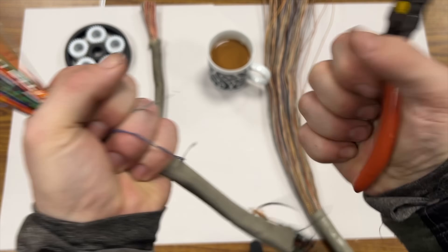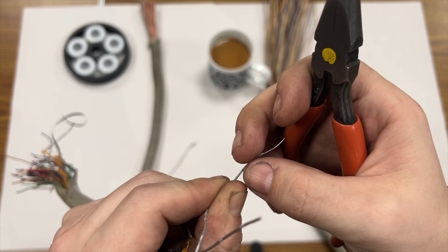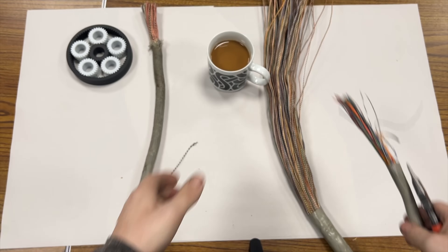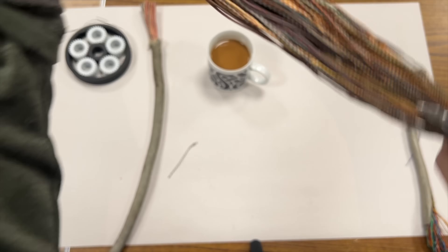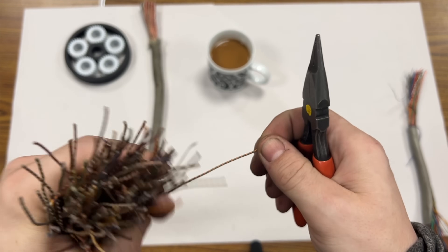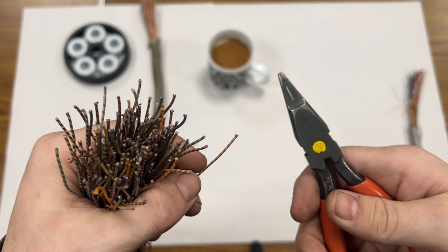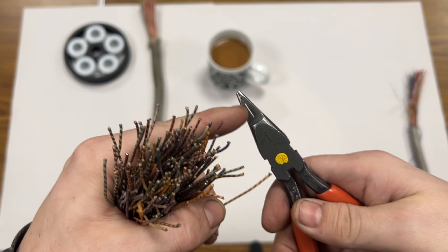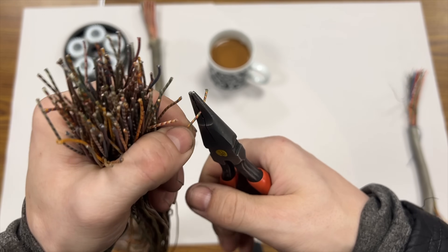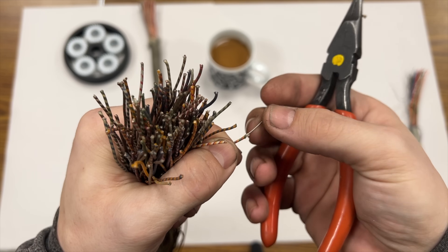When you want to strip this PIC cable, that's what it looks like when it's stripped. When you strip the pulp insulated one, this paper has some sort of radiation treatment or something, and these strippers have a little notch in the center — see that little rectangular notch. So when I put the conductor in there, listen for the crack. There's the conductor of that one.